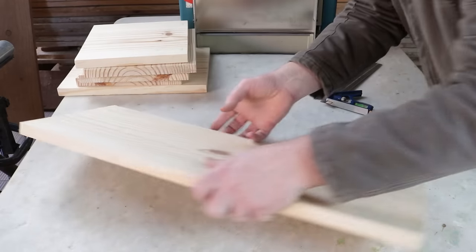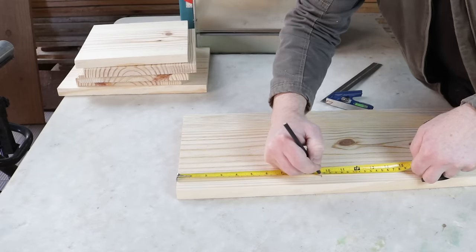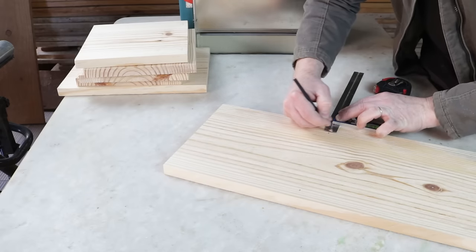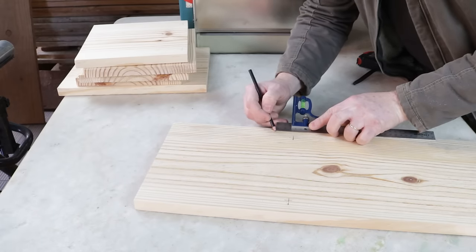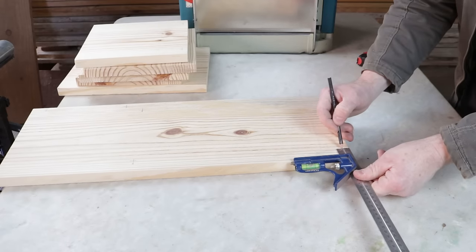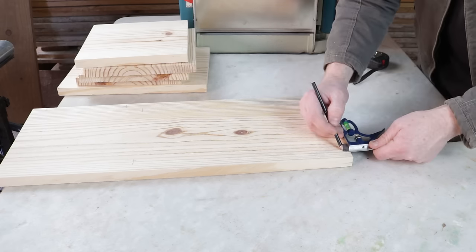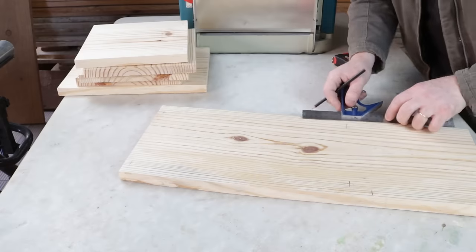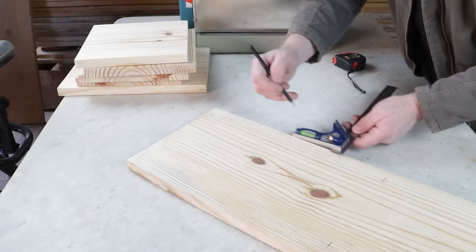On this part measuring 63 centimeters or 630 millimeters, I'll mark 24 centimeters from one of the ends. Again with the square positioned at the 3 centimeter mark, I'll mark in the opposite direction on both sides. I'll mark again around 3 centimeters above this mark and on the end too. Similarly, I'll do it on this other end — here's the 3 centimeter mark on both sides, with 11 millimeters in the opposite direction. I've already positioned 8 centimeters on the square. The next marking will be 9 centimeters or 90 millimeters below this, on both, drawn in the opposite direction with 11 millimeters.